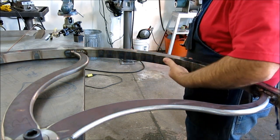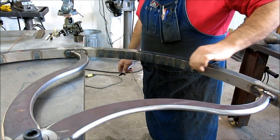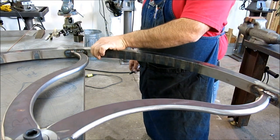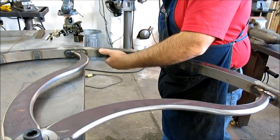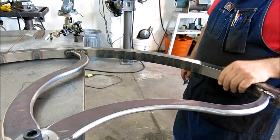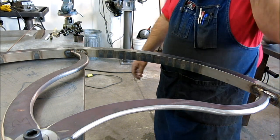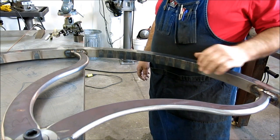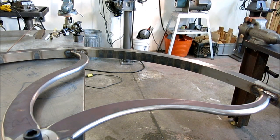This is going to get painted, and these are just heat discoloration. There's no bumps to feel or anything like that. On thin material, sometimes you get a little swelling or an upset, but on thick stuff you don't. So that would just polish off if we wanted to keep this unpainted. But this thing is going to get painted a really rich, deep brick red is what this wheel is going to be. Anyway, so I just wanted to show that corrective process.